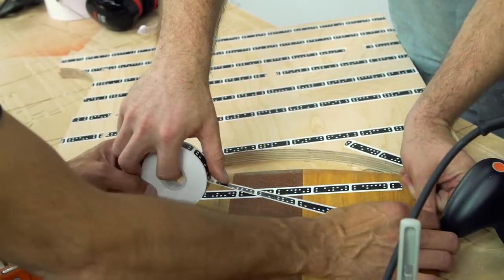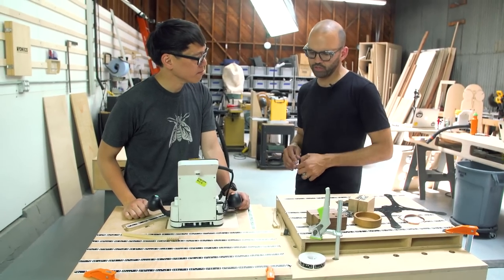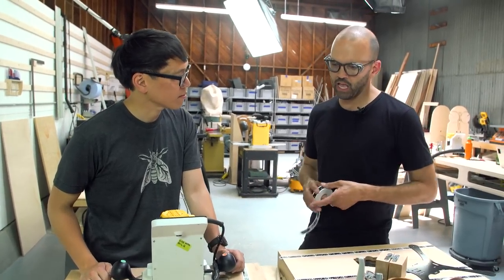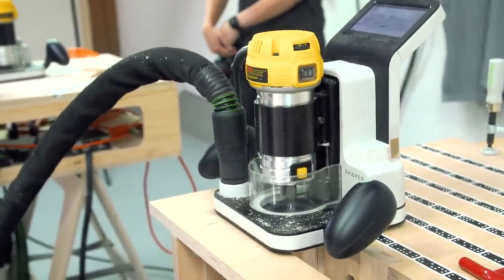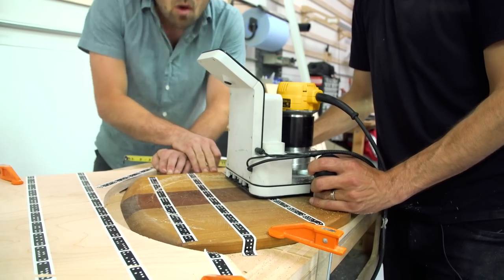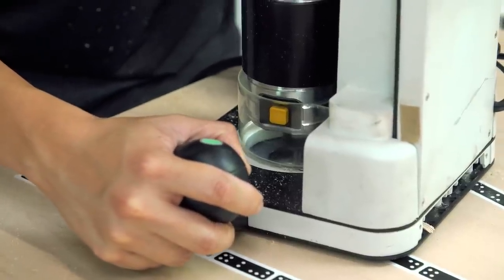What's step one to get this working? I see a lot of these that look like fiducial markers but almost like dominoes. We've developed a fiducial marker system — it's a tape, a low-cost disposable tape. It just comes off on a reel like this and it's pretty easy. You just slap it down. It doesn't really matter what the orientation is, it doesn't need to be parallel. The only thing that's important is that the image sensor, the camera, can see some number of those markers at any given time. If it sees those markers, it knows where it's at and it knows where it needs to be relative to where it thinks it needs to be.